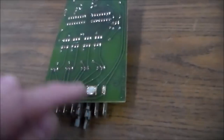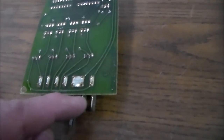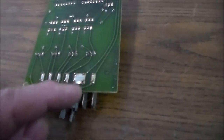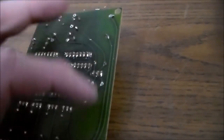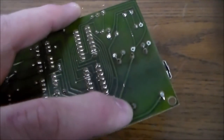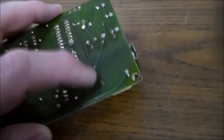So we're going to have to check to make sure all of that's wired right, right? So the power comes in here, the neutral comes in here, but it also goes right back out on this wire, right? But then both of them go across, and they go over to here and here, right? Which is this big transformer.